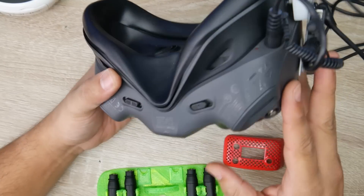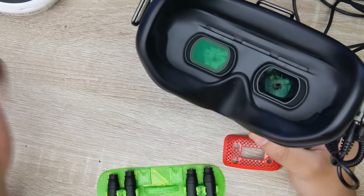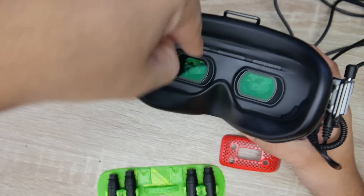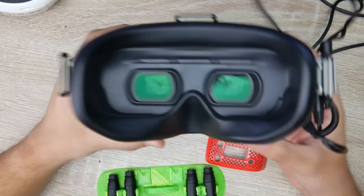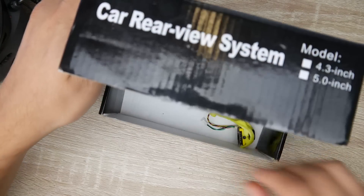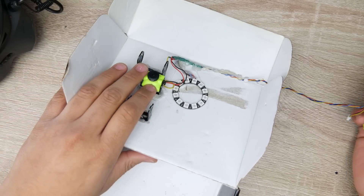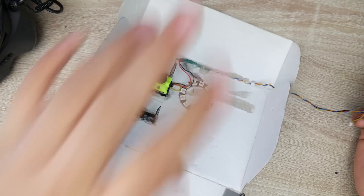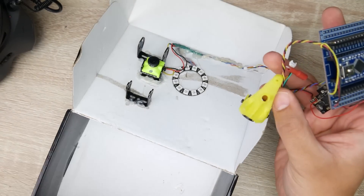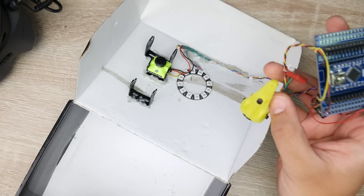This 35 milliseconds, plus however much latency your camera has, gives you your total glass-to-glass latency — from the camera all the way to what you see. The latency was tested from the screen. For the testing setup, I've always wanted to 3D print a box for latency testing, but I just found this cardboard box which has been doing the job. I put the cameras inside to test their latencies, and for the goggle latency test I used two identical Caddx Turbo F1 cameras, which both have 1.4 to 1.5 millisecond latency — very stable, never going above or below.